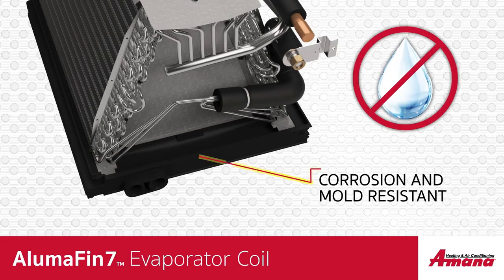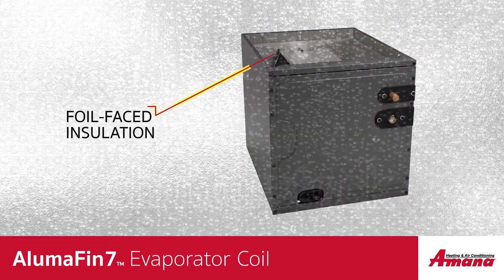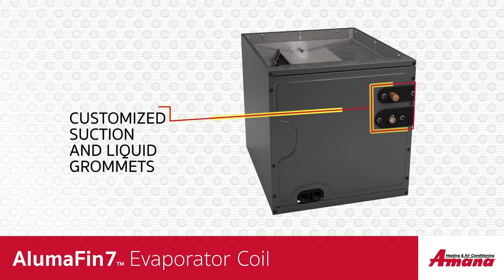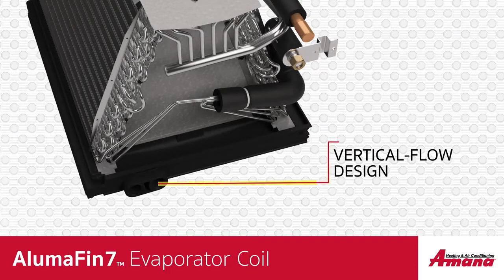Corrosion and mold resistant thermoplastic drain pan features no water retention design. Foil-faced insulation covers the internal casing to reduce cabinet condensation. Seal-tight customized suction and liquid grommets for easy installation and removal. Thermoplastic drain pan with secondary drain connections feature vertical flow design allowing for upflow and downflow installations.